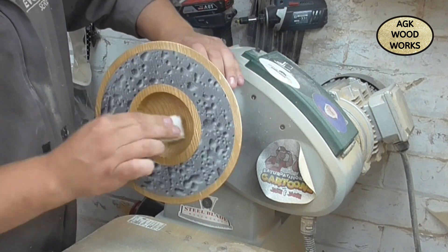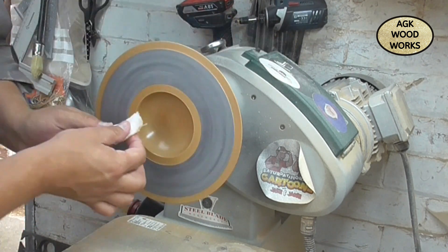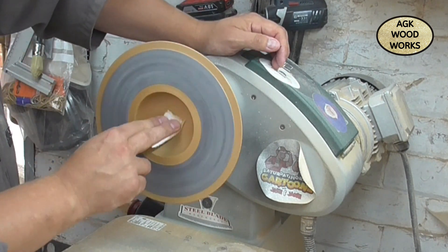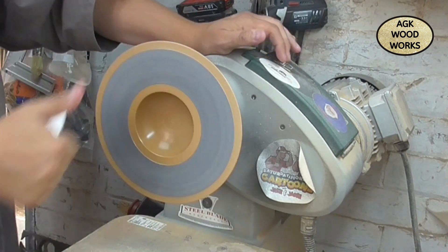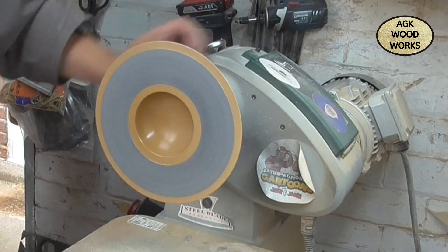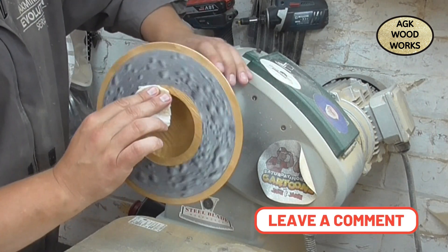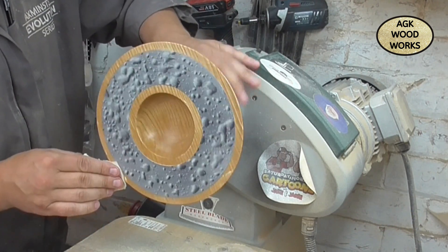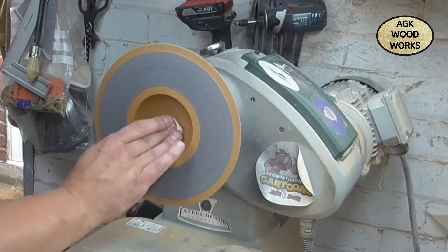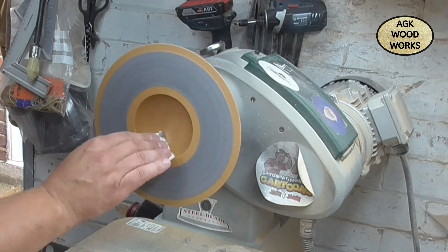Now with the Yorkshire Grit — that's all off — and then back to the Wood Wax 22, put one coat of that on, just trying to get to that edge but not quite overlap onto the paint, and then buffing it off. I also add a coat of microcrystalline wax. You can see on the tissue where I got a little bit too close and it started taking a little bit off — that's why I try to be as gentle as possible while doing that.